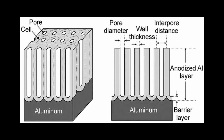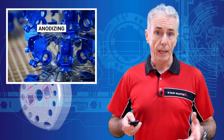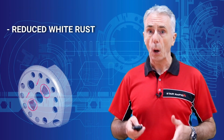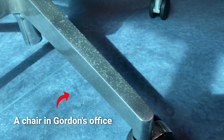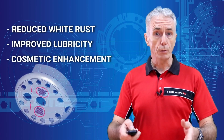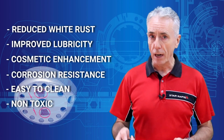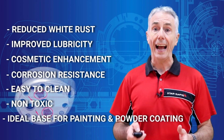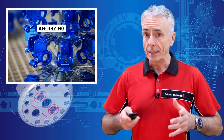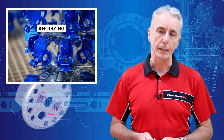That shell is also known as a barrier layer or anodic film. Here are some major benefits if you're considering using anodizing on your project: reduced white rust — you've all seen it, looks like spots of white mold on aluminium — improved lubricity, cosmetic enhancement, corrosion resistance, easy to clean, environmentally benign and non-toxic, and it makes an ideal base for painting or powder coating. All of this together significantly reduces the maintenance cost of your product, but also increases longevity.